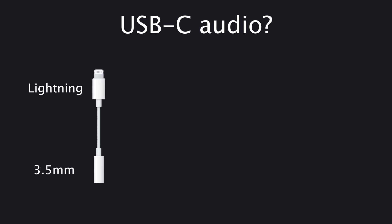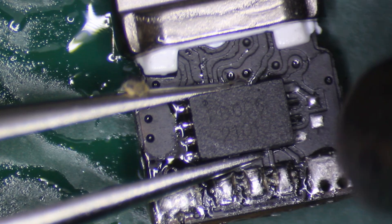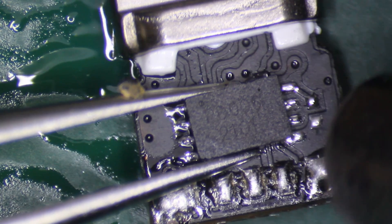I thought it would be cool if you could also pass audio through the USB-C port, so I did some digging. Turns out Apple makes two adapters. This one has widely been hacked and I could have integrated it in my circuit, but the problem is it only has audio in one direction — from the lightning port to your wired headphones. That's not what we want. The other adapter costs $35 and allows audio in both directions, from a host device to a lightning port, which is what we want. The problem is the handshake hasn't been cracked yet, so I would need to steal the chip from an original adapter for each board. Too expensive. We'll stick to wireless.